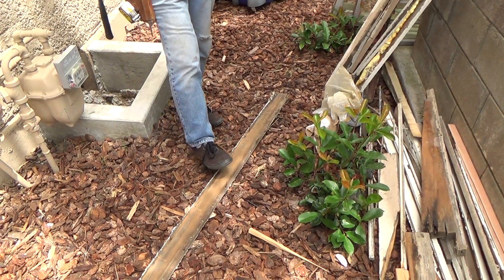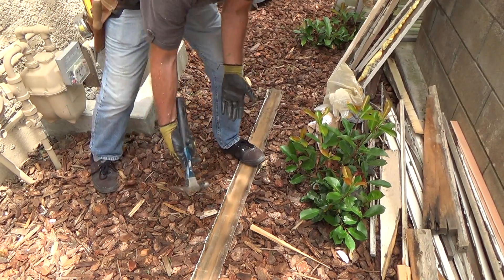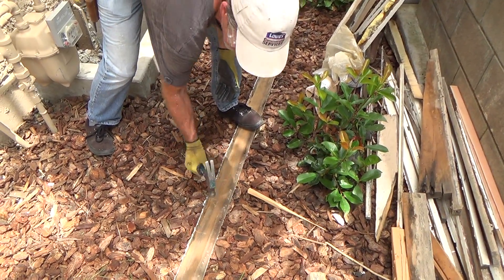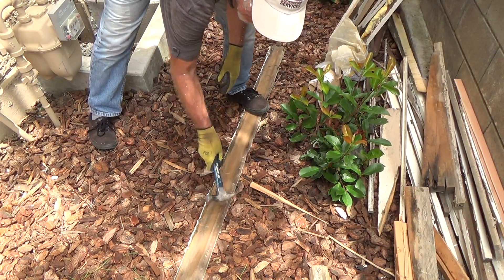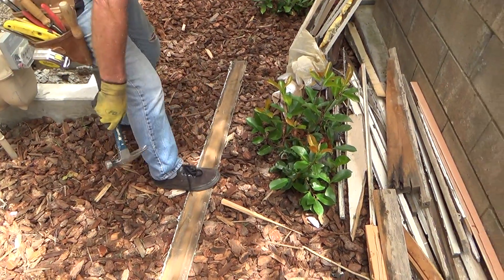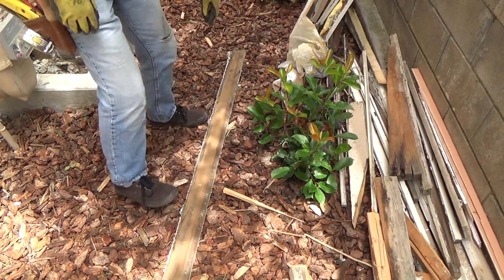You might think you have boots on so you'll be fine, but these nails go right through boots. I know because I've done it. So I never take a chance. I see a piece of trim like this, put my foot on it, and use my hammer — just run it sideways like that. Take all the nails down and be careful, because you might think they're all down and then step right on one.